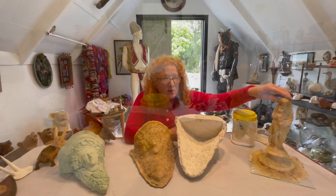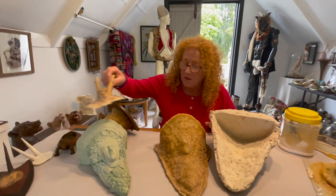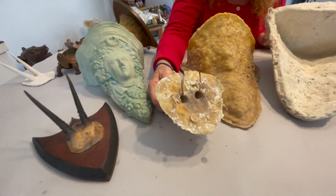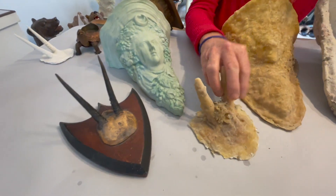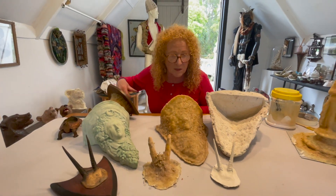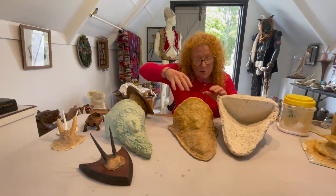You just do multiple layers. Now as you come to the end of what I usually say is 10 layers — 10 layers is exactly what this one is. It's a good thickness but I've made a big mistake on this one: I went too thick. I thought originally I'd just have it self-supporting, but I've gone ridiculously thick and when I try to pull out the delicate horns they snap over and over again. Something light like this really probably only requires five layers and doesn't need a big support system. The lighter the amount of cement you're going to pour, the less of a support system you need.